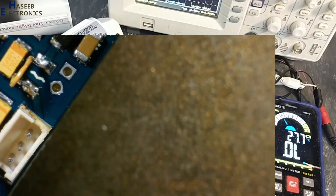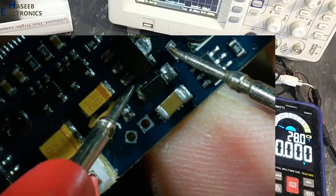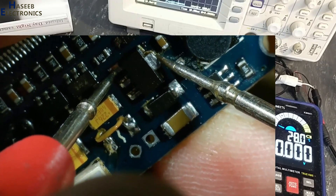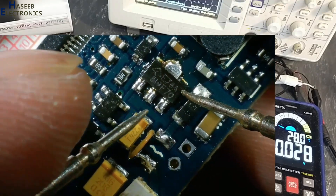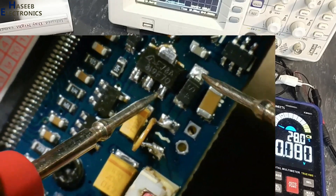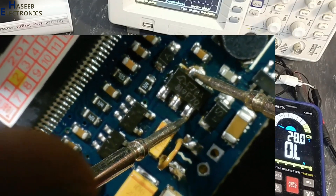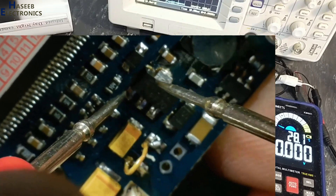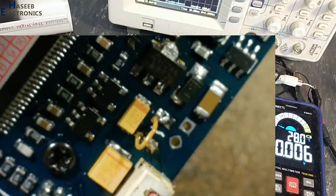Let's supply DC voltage. Yes, the input of this regulator — this regulator — is marked E78A, which is a 5V regulator. The positive voltage is reaching here at this pin, and this is the ground tab, but there is no output from this regulator. That means this regulator caused the damage to this fuse. This is the 5V regulator 7805, E78A code.